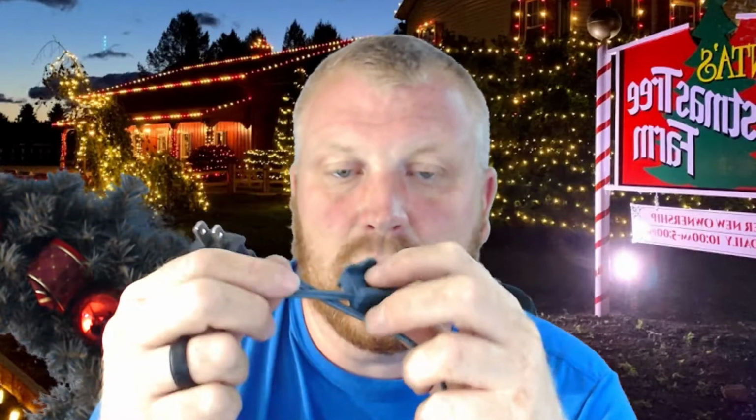The other thing is these plugs only go in one way. I don't know if you'll be able to see, but the bottom one right here is actually a bigger plug than the top one, so it will only plug in one way, like so. Whenever I'm plugging an extension cord into a female or anything like that, I always twist them like so and plug them in, and that way when I go to take down, it's all going to come down and not come unplugged.